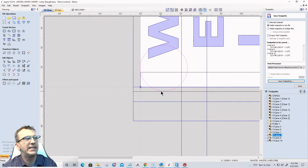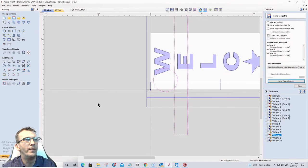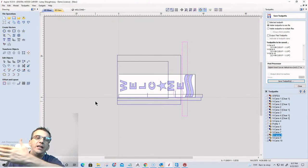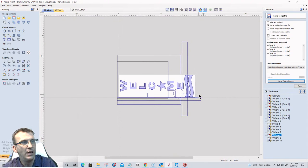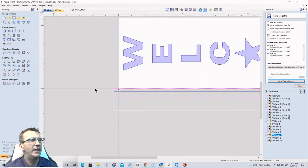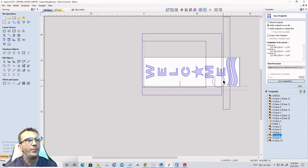And I kiss that bit up against the straight edge, clamp that end down, then I move my gantry down to the other end of the table, and make sure my straight edge is up against the bit, secure that end down. That way I know my straight edge is running true with my CNC's gantry travel, right? With my router travel. So now that I have that straight edge and everything on there, I clamp down. Now I have a reference fence, like a fence on a table saw, that my board can slide down as I'm carving and everything.